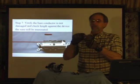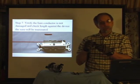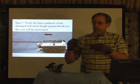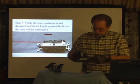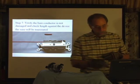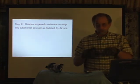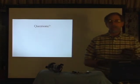Now we're going to look at the stripped portion and make sure that we haven't nicked it somewhere. If we nick it, it's kind of like glass. If it vibrates or bends very much, it will break. Then we take the wire and compare it to the gauge and see that we've cut it the correct length. If it's too short, then you strip a little bit more. If it's too long, you can use your cutters to trim it off a little bit. Do you have any questions?